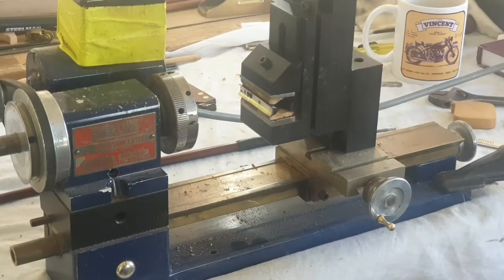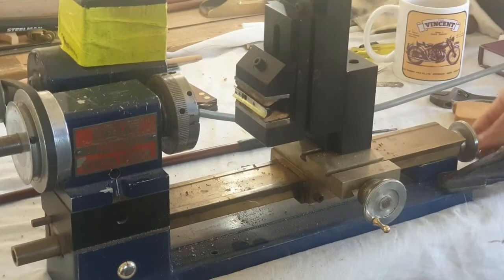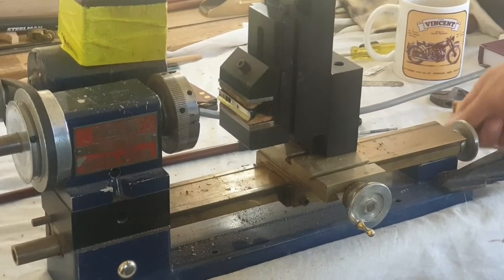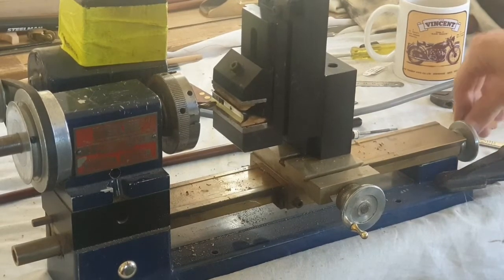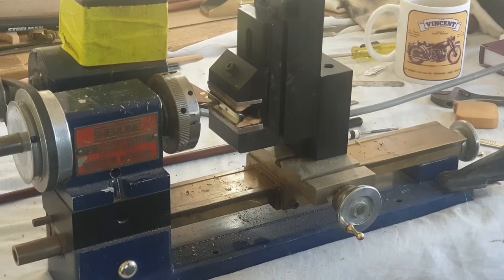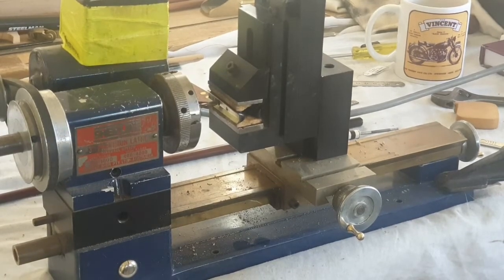Okay, so we've lined that up in line with the original position of the original hole and on the same incorrect angle, so that we'll drill it out in line with the position of the original hole. I'll just check to make sure that that's not going to take too much out of one side or the other, and we'll drill that out. And look at what sort of size and how much material we need to remove in order to get enough area around our bushing so that the repair works.